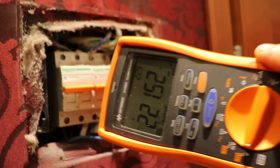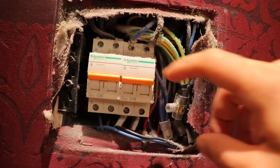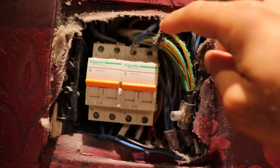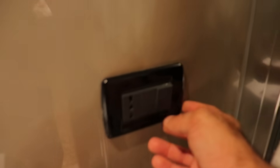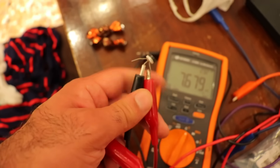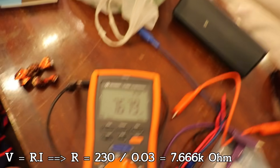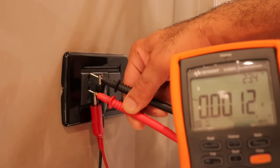Because I'll need to measure the voltage single-handedly, holding the camera with the other hand. Yep, 220 volts. Let's see if the black is in fact neutral. Yes, black is neutral. So just two basic breakers, and interestingly they disconnect both live and neutral. I don't see any ground fault protection. I have a potentiometer here and I tune it to around 7.5 kilohms for around 30 milliamps of current, and hopefully that will trigger any ground fault protection if there is any. Let's plug in the potentiometer between earth and live.